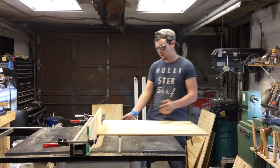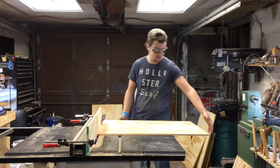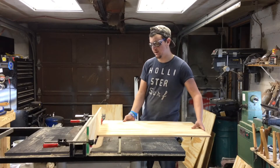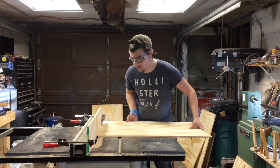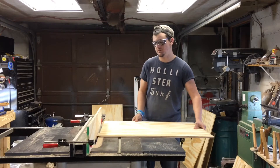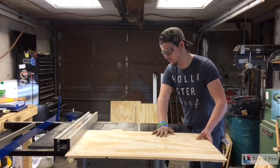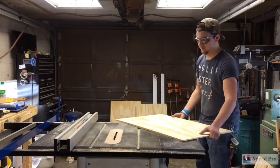To make this cut, you can't really use a miter gauge because it won't fit and I don't have a cross-cut sled. So you hold your hand here and push it towards the fence — you can't have it rock in any way or you'll get a really bad kickback. Right here I'm making the dados, being very careful not to have the wood rock at all.